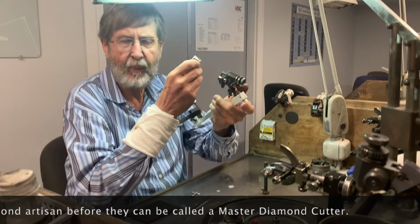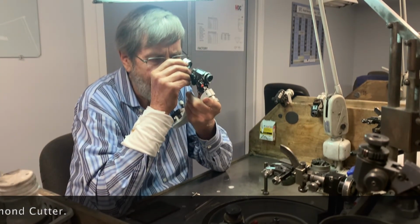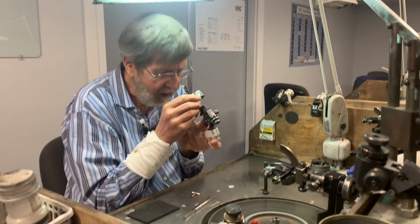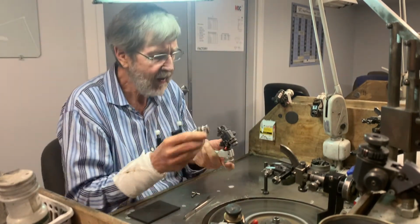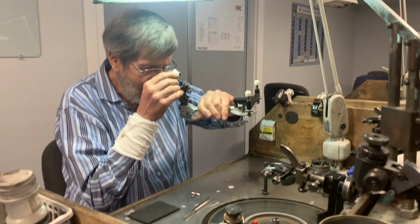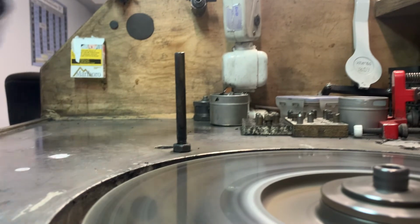And after the creation of the 8 facets, we will be scanning the diamond to determine the table size and see if it's correct, and do any corrections thereafter as well. Also, the table facets need to be polished before we start with the star facets and crown girdle facets. So without further ado, let us get going then.